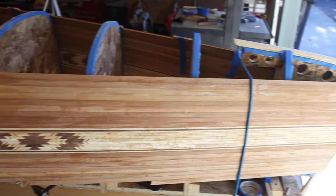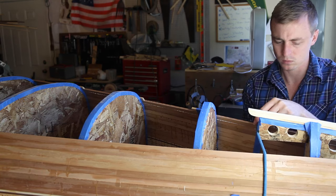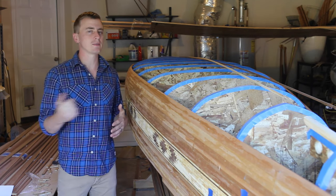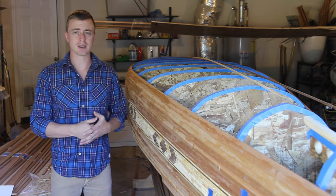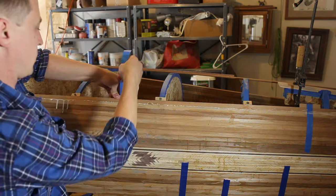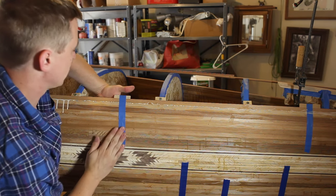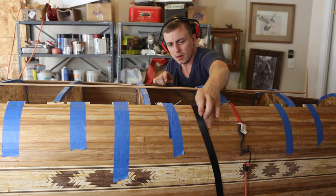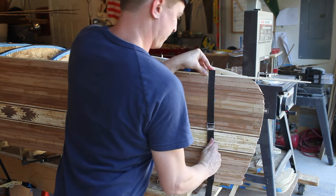As I start rounding over to the bottom of the boat, it gets a little bit more tricky to bend the strips into shape. For the last boat I built, I just stapled the strips right onto the molds. That leaves little staple holes you can see when you finish, but it also makes mounting the strips a lot easier. If you're trying to do this without staples, you're just going to have to get creative with some of your clamping. To clamp my strips on, I've been screwing these little scraps onto the molds, taping onto the previous strips, and for some of the more difficult curves, I'm using bungee cords and tie-down straps. There's a lot of different ways you can do this, so my best advice is just do some research and try some different things until you find a method you're comfortable with.